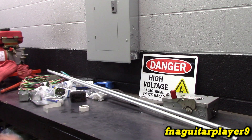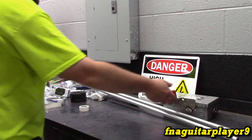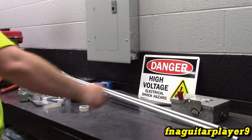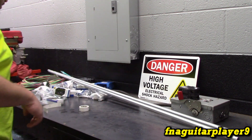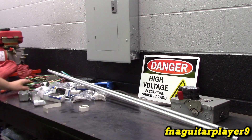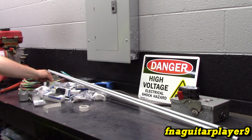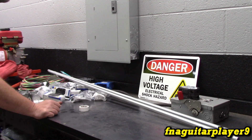We're going to run about four circuits. I picked up this sign to put up here - sometimes I do high voltage experiments so I thought it'd be neat to have. My disconnect switch ran off a 30 amp 220 breaker just for doing testing videos. We have various receptacles and fittings for the half-inch EMT, and a 50-foot roll of four-conductor wire. The red wire won't be used - it's got red, black, white, and green - but it's left in there just in case we ever want to add something or run 220.